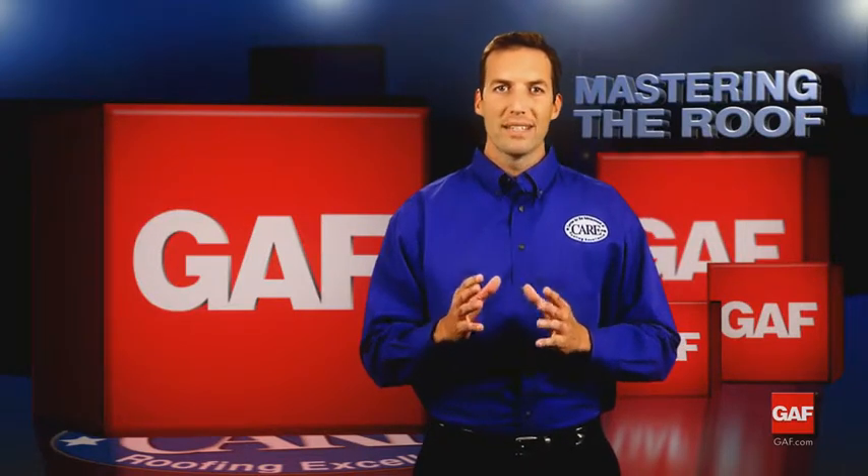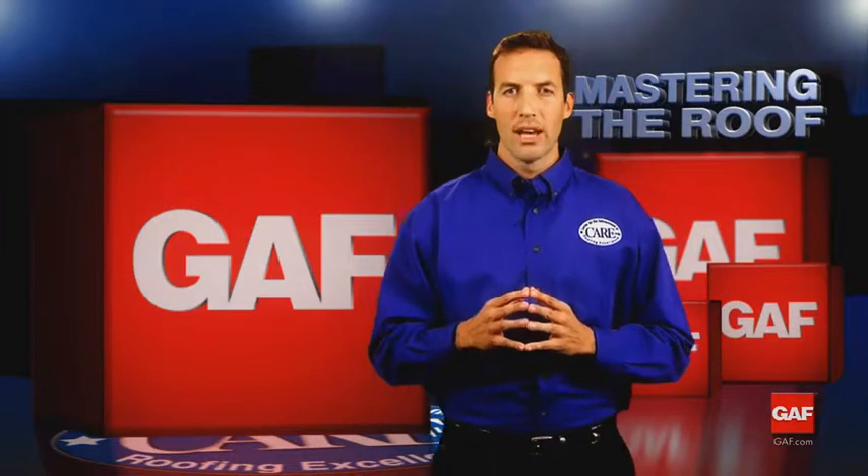The purpose of a good roof system is to keep the roof deck dry. If the deck gets wet, it can cause blistering in the overlying roofing. It can also cause problems inside the house, like wet insulation or stains on the walls and ceilings. The moisture can also cause degradation of the deck itself, like delamination or rot.